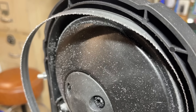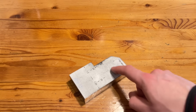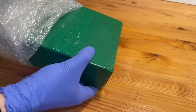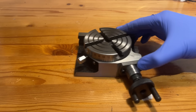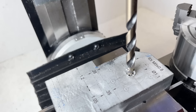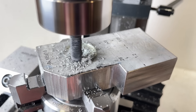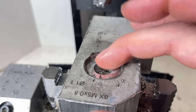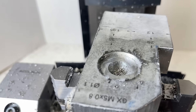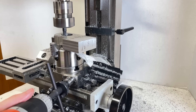We have the main shape of our Z axis bracket cut out despite some minor technical difficulties, but we're far from having all the features cut. The main difficulty is this large hole — I don't have a boring bar for the mill and I don't think it's safe to put this in the lathe. Fortunately, I have a super cheap rotary table I was skeptical about, but trying it out, I'm pleased to report it went extremely well — way better than it has any right to considering how much it cost. I got tired of turning the hand wheel pretty quick and found a trick with the chuck key to help.